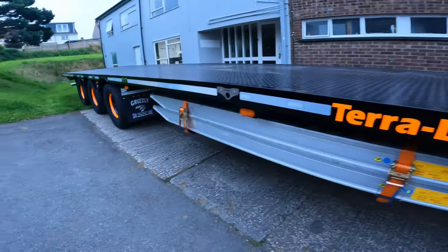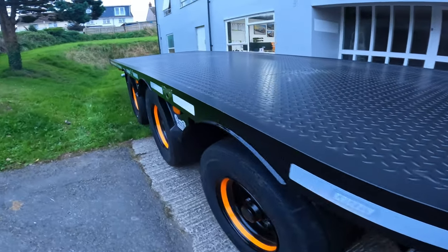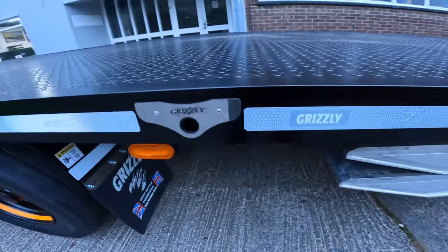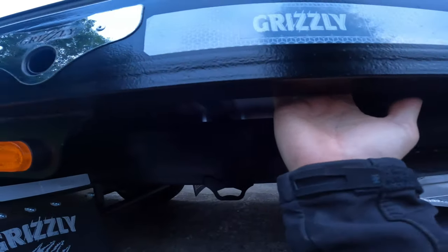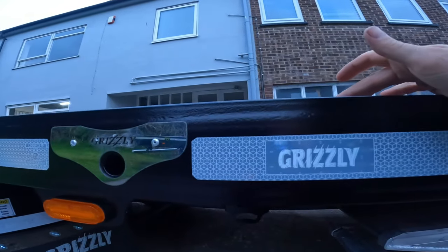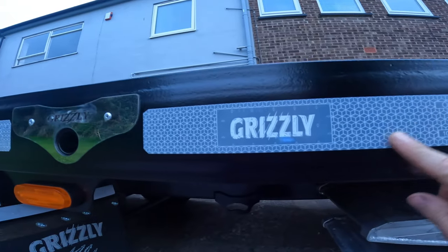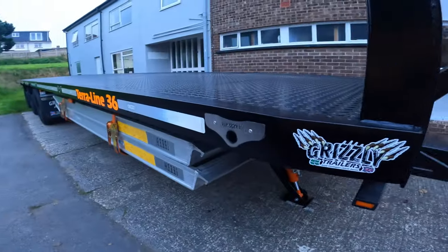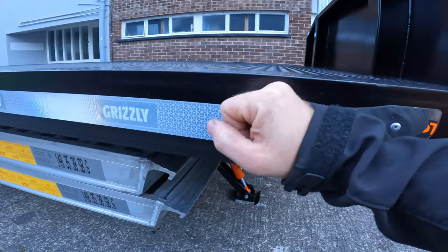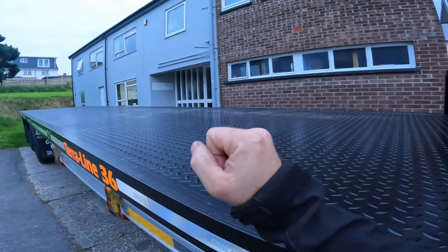All our bail trailers are fitted with PFC 65mm x 125mm channels. The reason for that is you can strap anywhere on the trailer and your strap doesn't ruin the paint on the side rail. A lot of manufacturers use angle iron and the paint gets taken off the side — and that just bugs me. Our mirrored stainless anti-scratch guards mean a strap can be hooked on, rubs against the trailer, doesn't take the paint off, and basically lets you pull on a diagonal and pull things tight.